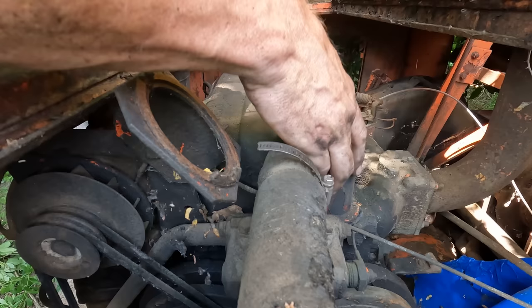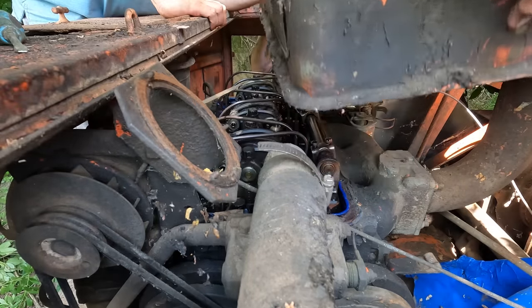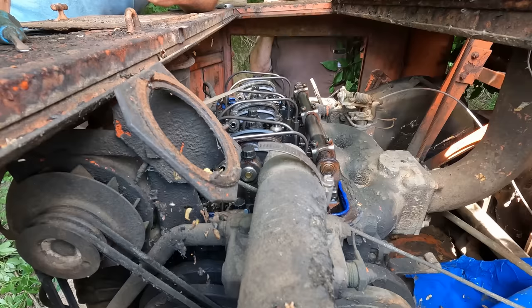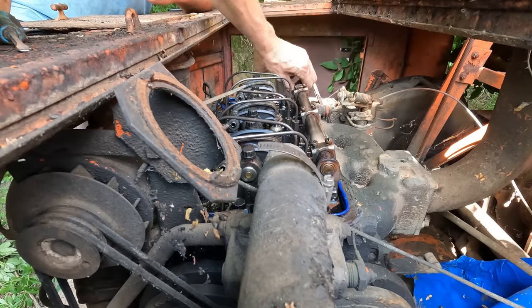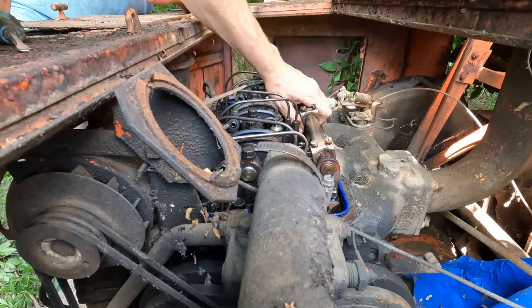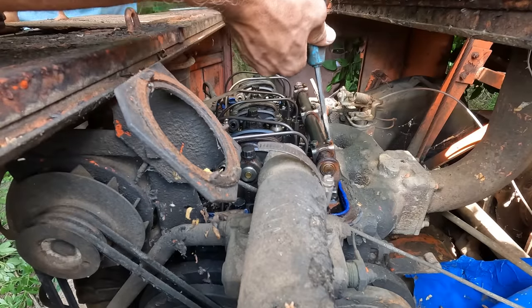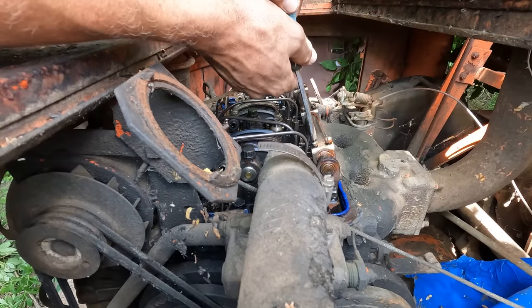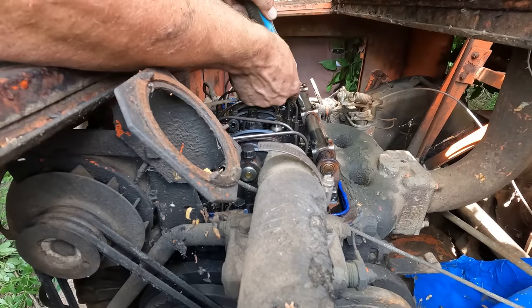All right, well, I think the valve cover should come off now. And look at that. It's like brand new. So, what always happens with these things, this is your fuel rack here, and the governor runs it from over here, and the injectors will hang up, and this rack should turn freely. They're probably all tight at this point, though. Well, that one's already loose.